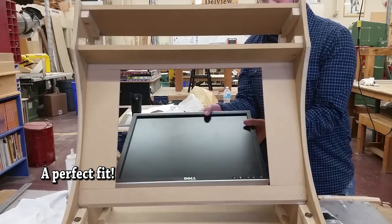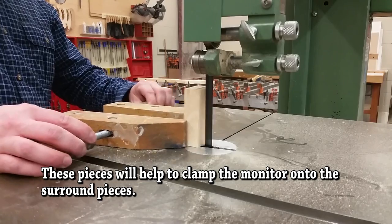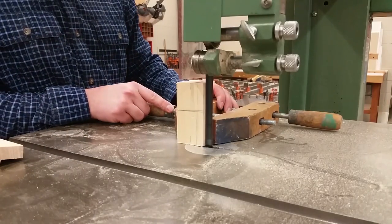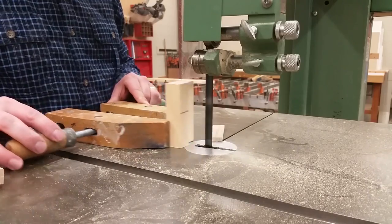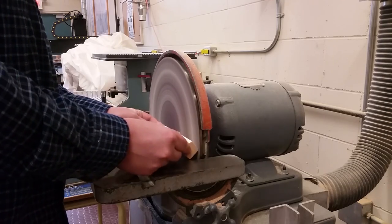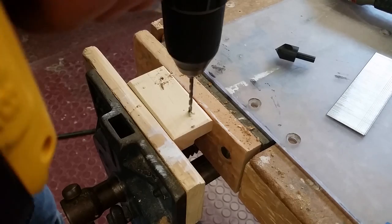There are lots of different ways to do this. I've seen a lot of different people on YouTube making videos, but I made this method up myself and it worked out very well. Here you see me making the brackets that will hold the monitor in place — very quick and simple, built out of scraps I had sitting around, I believe pine. These are essentially going to be clamps that clamp the monitor right to the surround piece I built. Sand them out even though you won't see them — I like to make everything look nice and rounded.